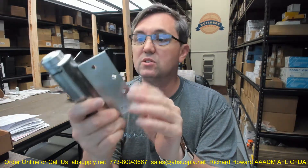This is a 6-inch single-acting spring hinge, UL listed, steel base, satin chrome plated. The 4030 is a single-acting spring hinge by Bommer. The dash 6 is a reference to the size. The dash 652 is the finish, which means it's made of steel and that it is satin chrome plated.